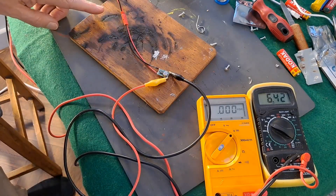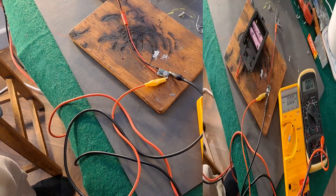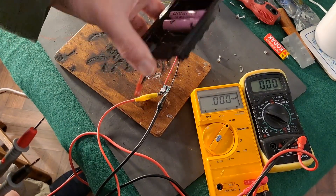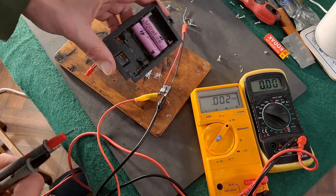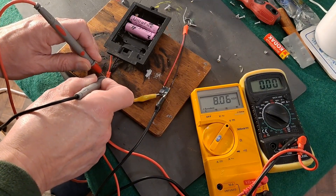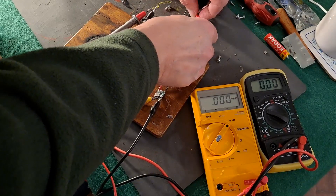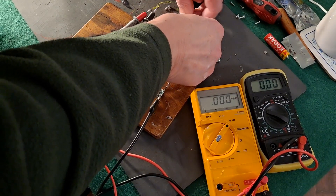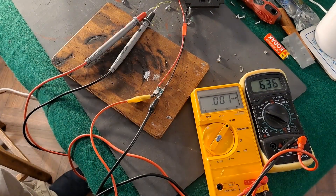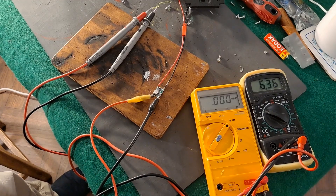So what we want now, instead of using a 12 volt input, we're talking about using two of these at about 8 volts. Let's see what I can rig up so we can try that. I've now rigged up a temporary little battery box for two of these 14500s, so we should be getting about 8 volts out of them. Oh look at that — 8.06. So we'll now plug them in. We're getting 6.36 on the output. That should do what we want. I could trim it a little bit more, but 6.36 is probably alright — just a little bit above 6 volts.